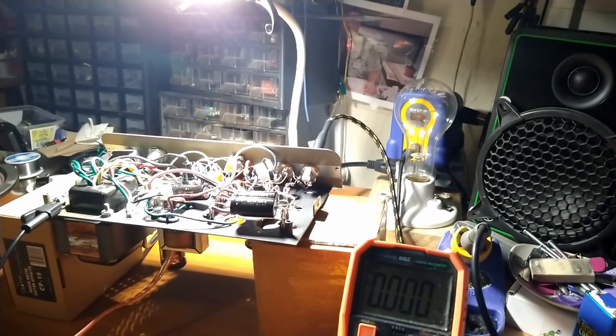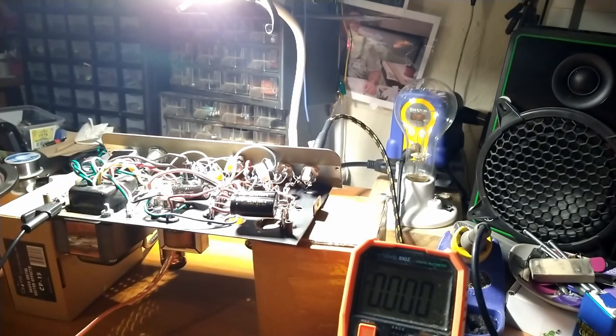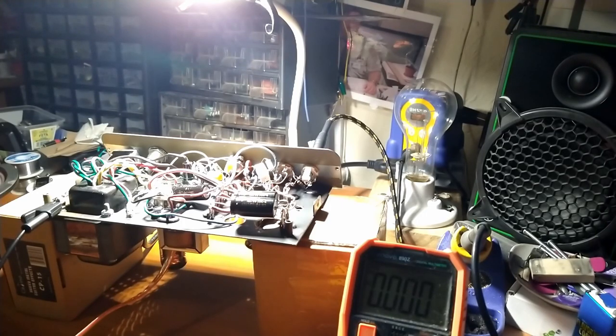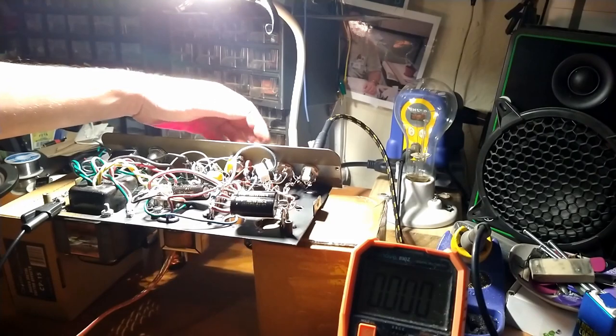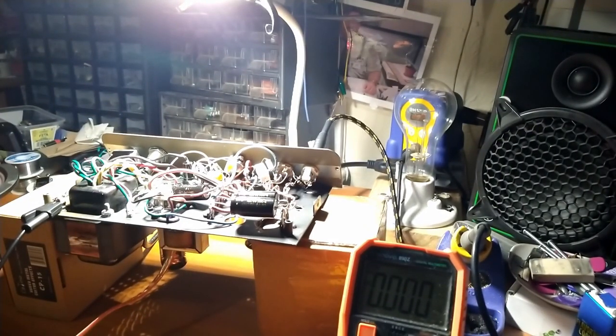Yeah, so far so good. Hopefully my horrible guitar playing doesn't bother you too bad. But yeah, this is definitely a step up from the last version of this thing that I built. There's no more hum. I think it had like transformer hum. It was a constant hum regardless of where the volume pot was. That is eliminated. It's cranked up to 10 and it's basically silent. And again, it's cranked up to 10 and we're not getting the oscillation, so that problem's been solved.